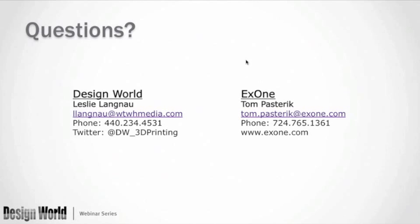And what are the disadvantages of your processes? The one thing with our process is we are only printing to 0.5% of any given feature. We are not to CNC machined tolerances. So we can get to near net shape, and we're getting better and better due to our printers, as well as particle sizes and the new technologies that are out there. And the other is our surface finish. Our surface finish will need to be polished if you are looking for an application for a smooth, polished surface.